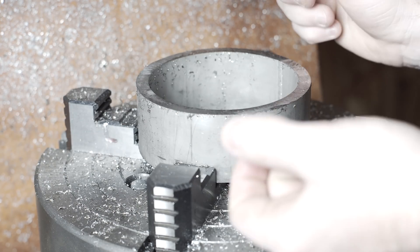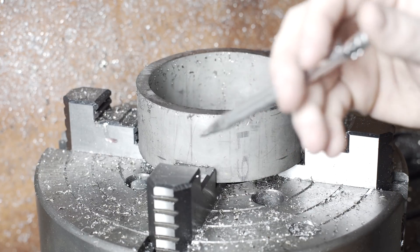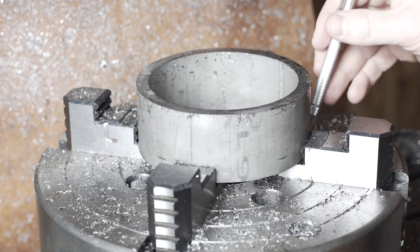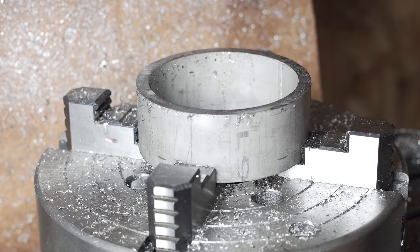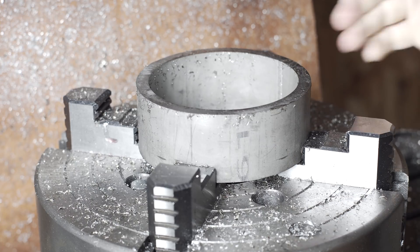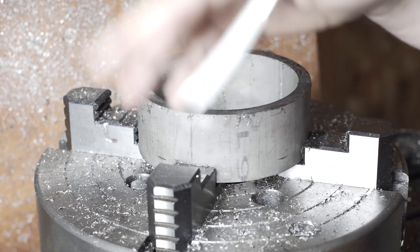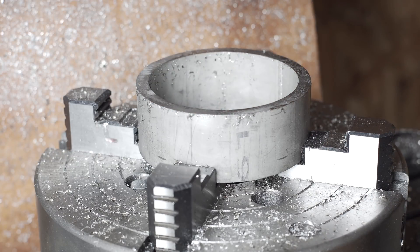The piece isn't flat enough to just spin it in the chuck, which meant I had to get everything in one pass without moving the setup — using the largest tool I had, which was the face mill. With a half-inch end mill I could only reach about half of the top piece before having to move something. I was being lazy about repositioning the chuck because the bolt holes are underneath. So I sucked it up, used a not-perfect tool, dealt with the chatter, and now I'll flip it over and use a proper end mill for a much cleaner cut.